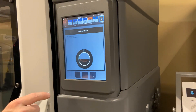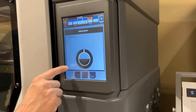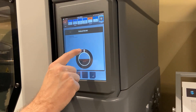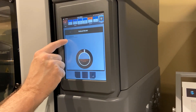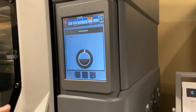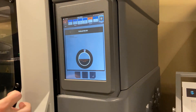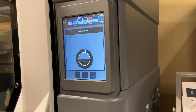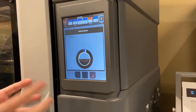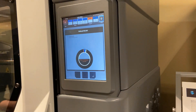Once those steps are done, arrow over to the next screen. At this point, the system begins the unloading process. It's going to take about eight minutes to unload the ASA and the support material so we can physically change out the tips. We can't do this until the material has been pulled out of the tip itself. So we'll wait those eight minutes and come back to continue.